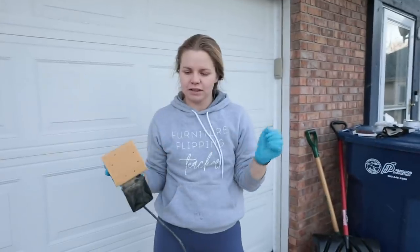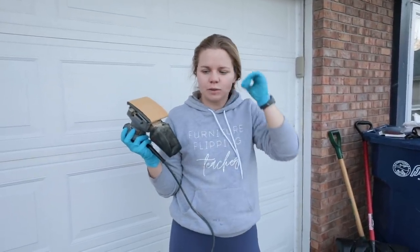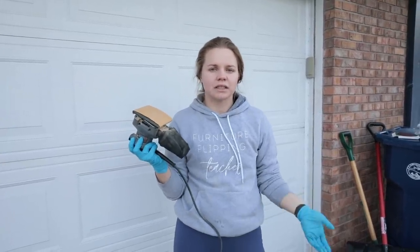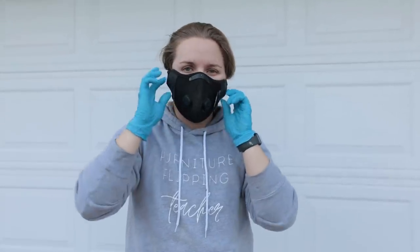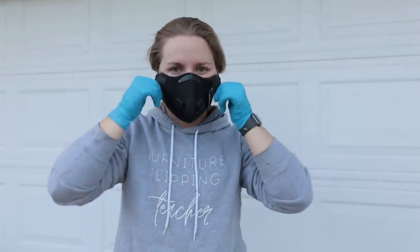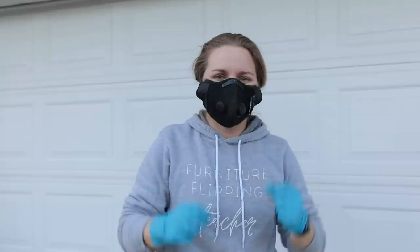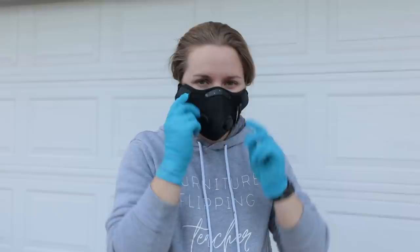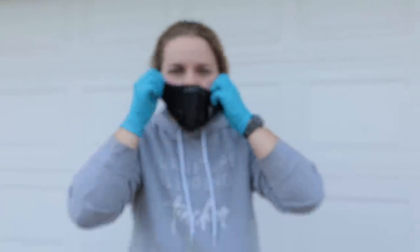With an 80 grit I'm going to sand down the top because I want to get it all the way down and smooth out the finish since I'm going to be staining it. On the bottom I'm just going to do a scuff sanding with a higher grit of sandpaper. I've gotten a lot of questions about this mask - it's linked in the description below. I love it because it still freshens the air, blocks out the dust without big giant filters on your face, and there's a filter inside.